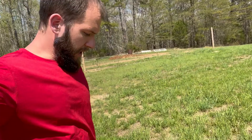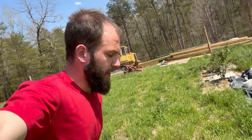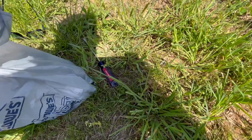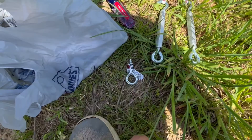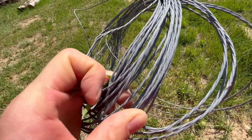It's a couple weeks later but I'm getting back on the trellis project. I have the cross pieces cut. From what we've seen online I think we can do a 24 inch piece on top, a couple inches from the top, and about a 20 inch piece about halfway in the middle. The bottom 20 inch piece I'm going to put two feet from the bottom, so you have about 40 inches between the bottom piece and the top piece. I also have all the hardware I think we're going to need — some tensioners to tighten down the cable tension, eye hooks to go into the wood, cable clamps, and some braided wire cable.